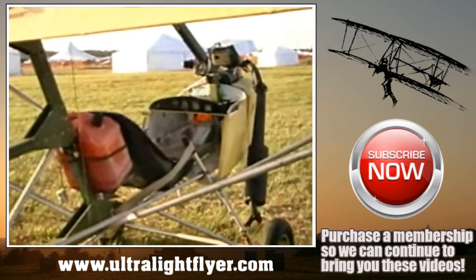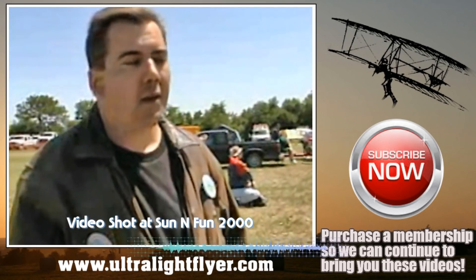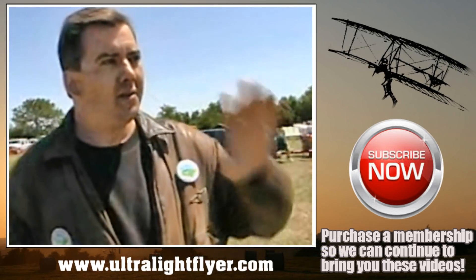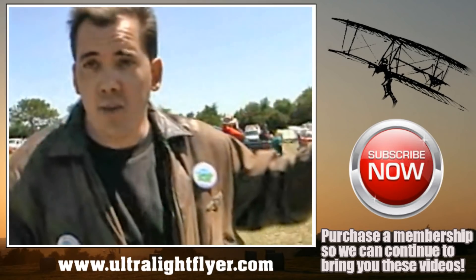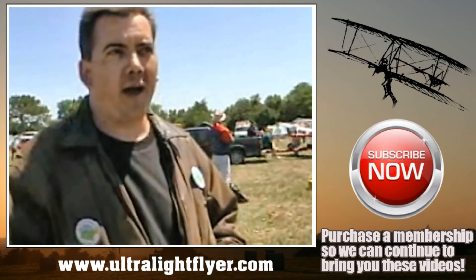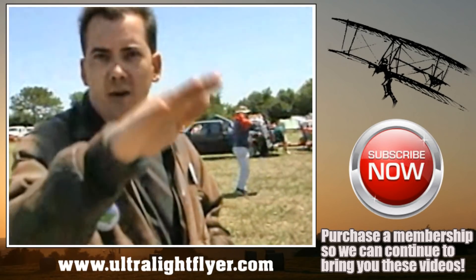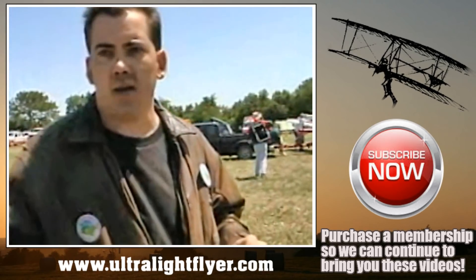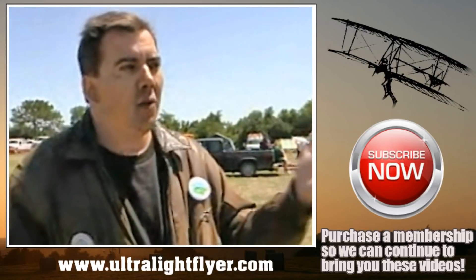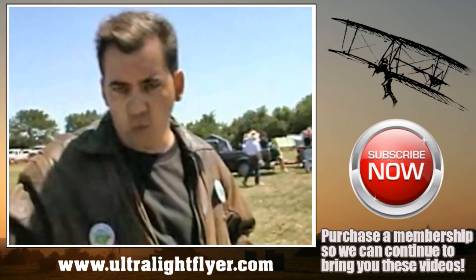Are the plans out there and ready to go now? Not yet. Last week we had an accident — a problem with the tailwheel, a gust of wind at the wrong time, and it took me into another airplane. She's not completely together yet. We were a week before the air show doing test flights, and I knew I needed to change the wing's curvature. We took her home, redid the wings, got a much better airfoil shape, and the first hops showed a complete difference. We should have the plans out within a month or so. They're about 90% complete and will be released once flight testing is done.